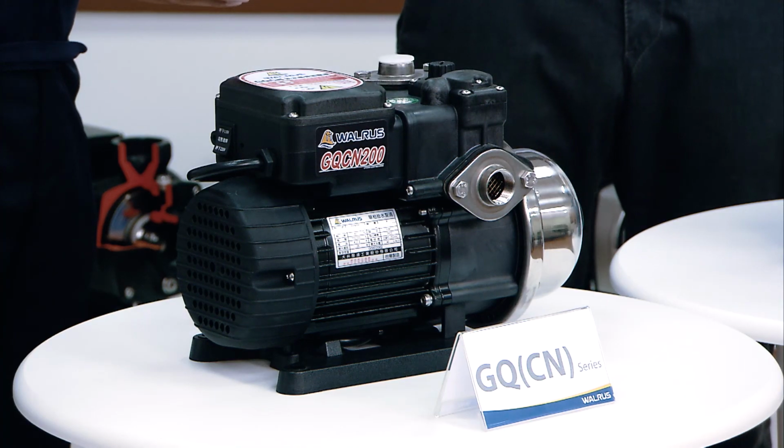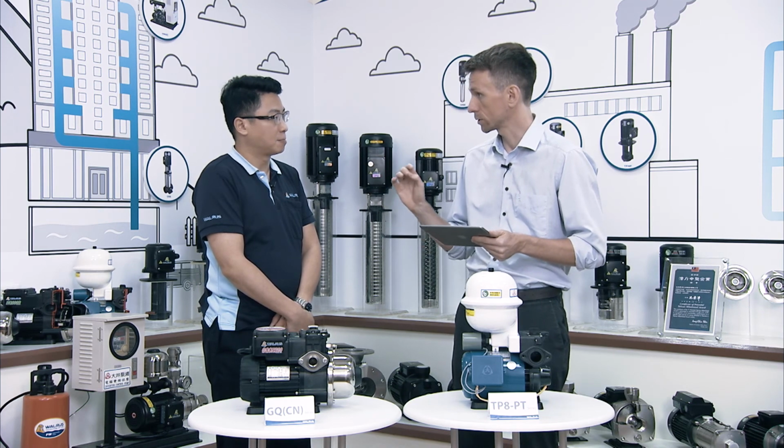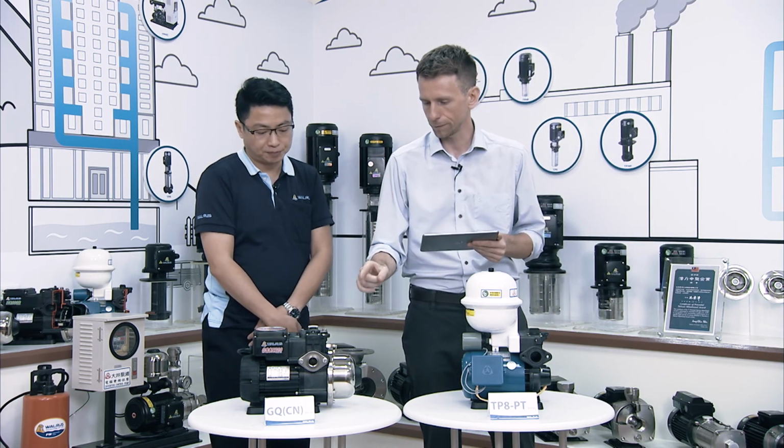So let's talk real quick about the main applications of the GQ series. Because the GQ series has a better air discharge ability, it can be used in hot water and solar water systems and suction lift applications. Those are the main applications, and specifically for solar heating systems, for solar panels. That's specifically for the GQCN, right? Yeah, GQCN is for the hot water version, and GQ is for the cold water.